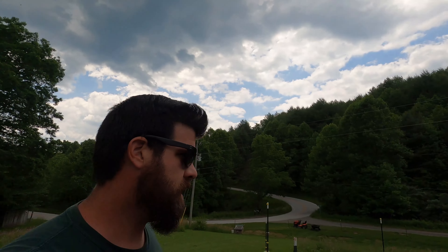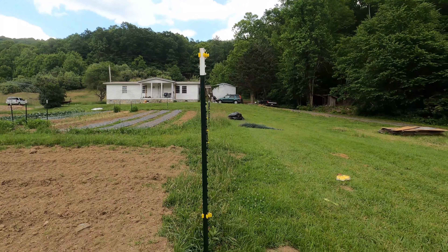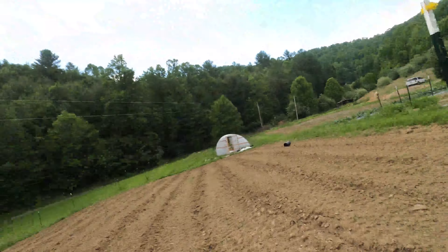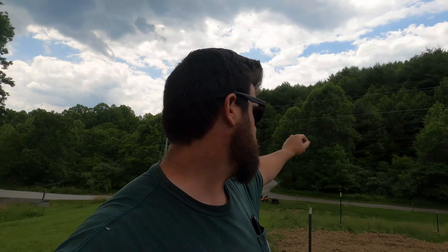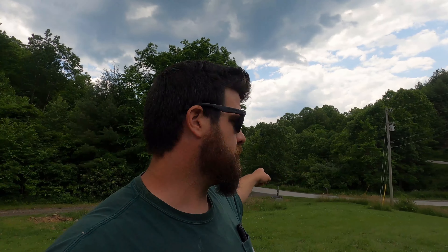I'm going to start working on the fence — I've already got about half of it done. I'm not using string or anything, just eyeballing my posts to get some hot wire up to keep the deer out. I'm doing six-foot posts and four-foot posts alternating all the way around, staggering them so at least one piece of hot wire is six feet up all the way around. I'll probably put a couple gates in so we can get the mower in and out. If I pull some extra four-foot posts from the old cattle fence, I'll have enough to finish today.